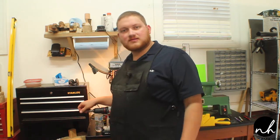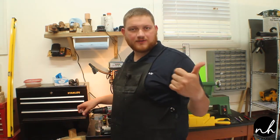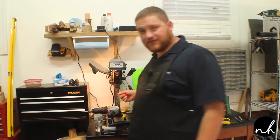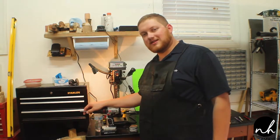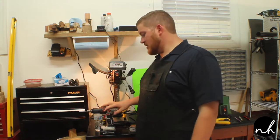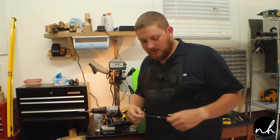The barrel trimmer, obviously there are multiple sizes of those because there are multiple size pens. Cigar pens, for example, are 10 millimeter. Slimline pens are 7 millimeter, just like you would need a different size drill bit depending on what type of pen you're making. After you get the brass tubes cleaned out of any excess glue and you have the ends squared up, or trued up, as they say, you're ready to start turning your pen. At that point, you're ready to put it on the lathe.